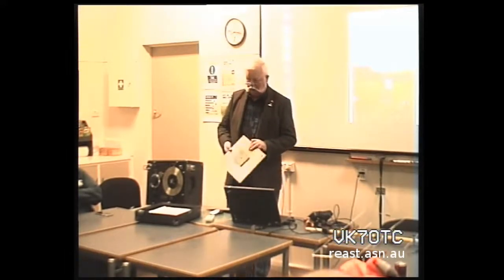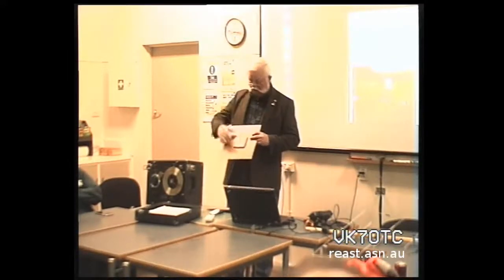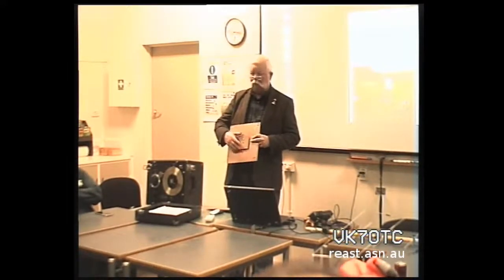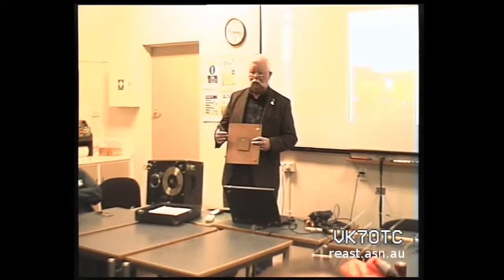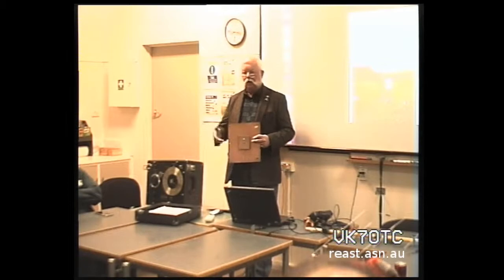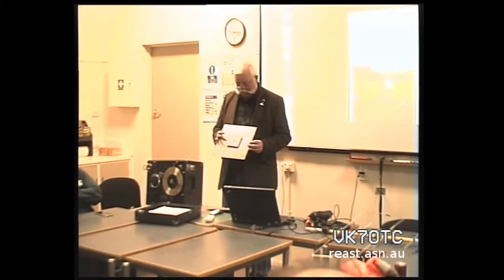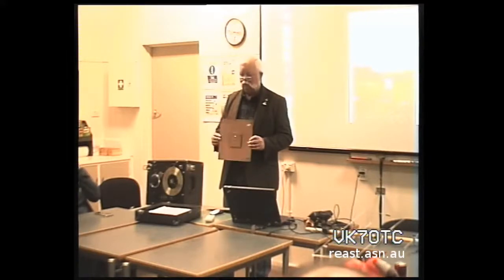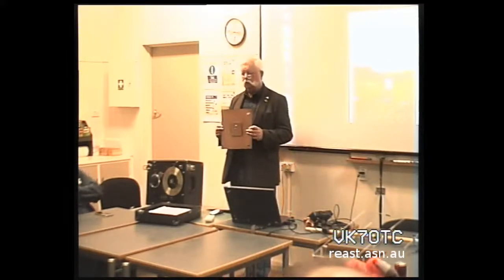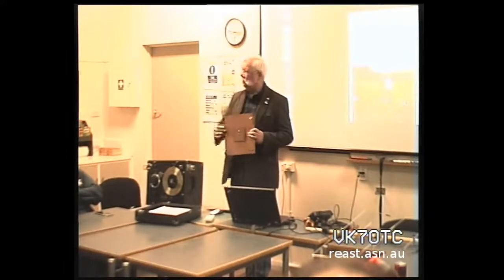I looked up on the net and found a lot of the theoretical stuff. And the theory for this shape is that it would be about 9 dB isotropic. So I'm not far off. 7 dB dipole, 9 dB isotropic, they're not far off equivalent. So it does 7 dB, and the other advantage of it, for what I'm using it for, is that it's quite a wide bandwidth.